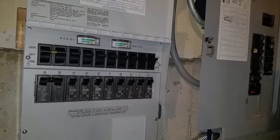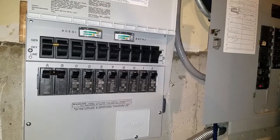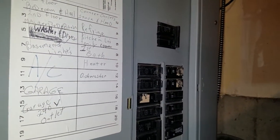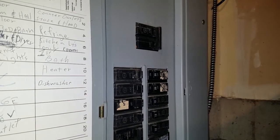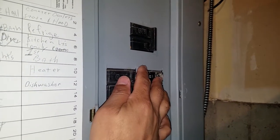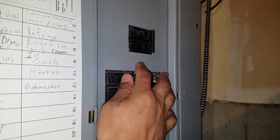Alright, so I wanted to give you an idea of what an interlock kit or interlock switch does. Now, I don't actually have one because we have a transfer switch. You can Google it and see YouTube videos about it. Basically it's a metal bracket that you get from the manufacturer of your control panel box, which in ours is GE, and you have to modify it by drilling holes into it so that you can put the switch in here. It's just a metal bracket.